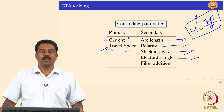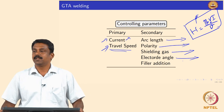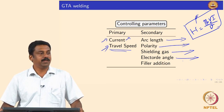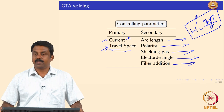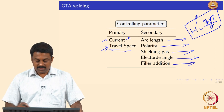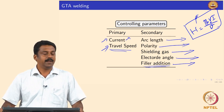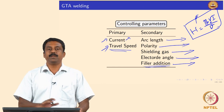We also looked at electrode angle and its influence on depth of penetration — changing the electrode angle changes the cathode spot, which changes the arc envelope dimensions. Filler addition is another secondary parameter that can change the melt pool temperature. Whether using cold wire or hot wire dipped into the melt pool, the pool temperature can be changed, and the filler addition rate can be varied to adjust melt pool temperature in GTAW with filler.